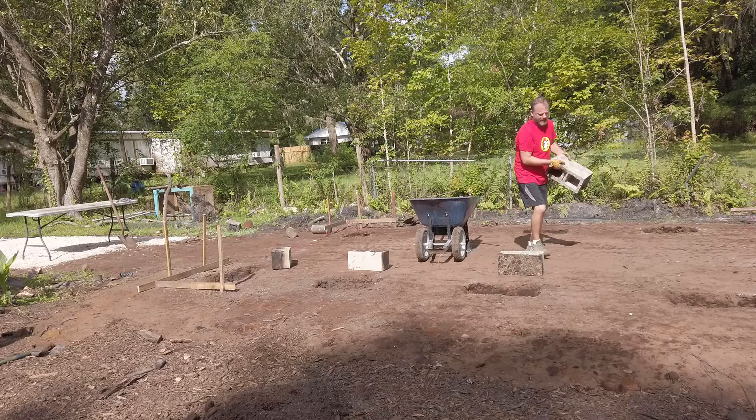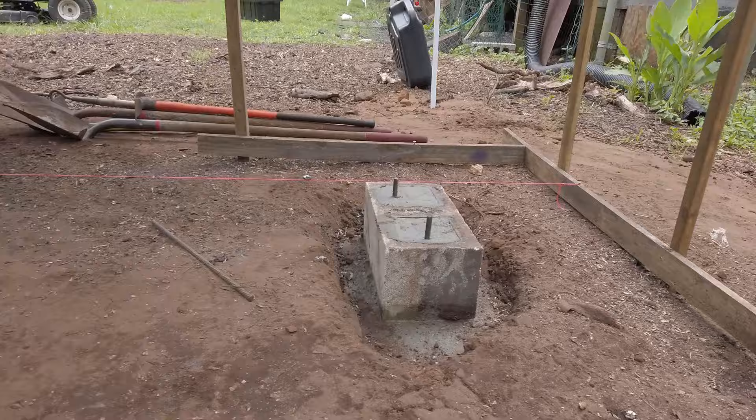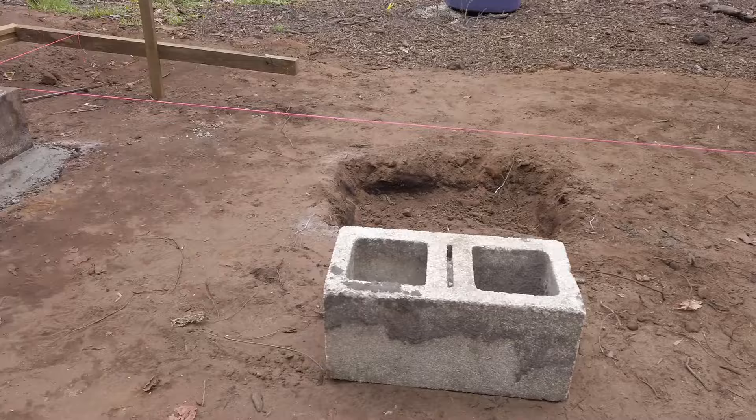Yesterday I was able to get the concrete blocks moved over from behind the wood chip pile and I was able to get the rebar cut. I needed 20 eighteen-inch lengths of rebar and 28-inch lengths of rebar, and that took a couple of hours using a Sawzall and a metal cutting blade. Around 3:30–4 o'clock yesterday I mixed up the first batch of concrete and got the front corner and back corner footer poured. It was about 5:30 at that point. It's very crucial to get these corner blocks set up appropriately, so I took a little extra time to make sure those were right.